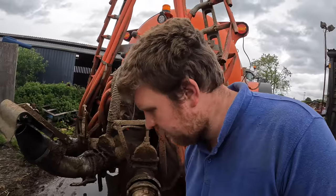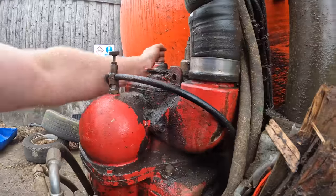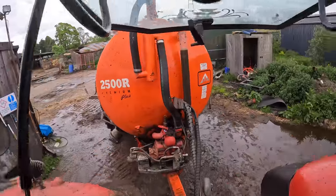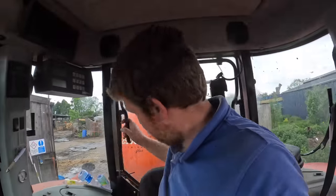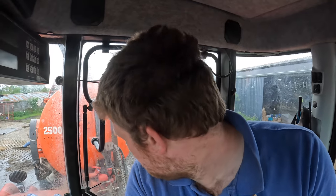On the other tanker, which is a hydraulic tanker too, you always had to get into the tractor, turn it off, get back out, then do all that. But with that safe shaft system — that lever on the outside just knocks off the flow of oil. Brilliant — never have to worry about getting caught because there's nothing to get caught in. Hydraulic is the way to go. The sight glass isn't working so well — it doesn't say I'm full but I am full, and as you've seen it didn't go up until I turned it off.